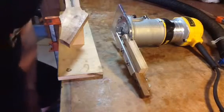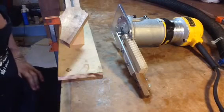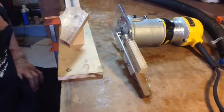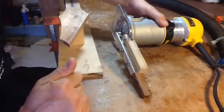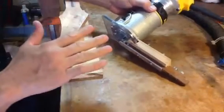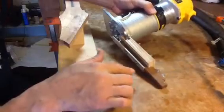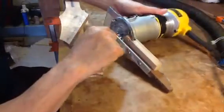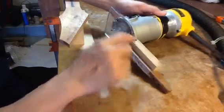Alright guys, next video - we're going to route the headstock for binding. I actually did a class on this jig a couple years ago at the Ukulele Guild. I just use this specifically for routing my headstocks. The other jig I have to route the binding is based on the same principle - I use the body with a quarter-inch downcut bit and the bearing foot, very similar to this.